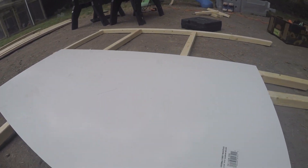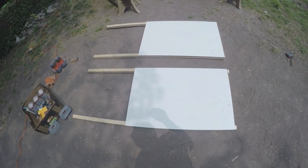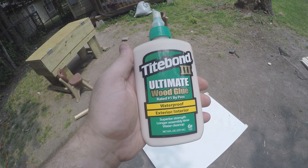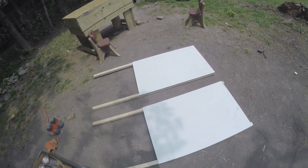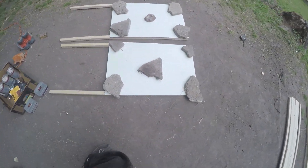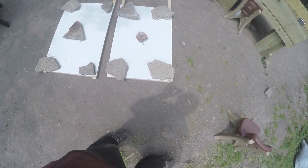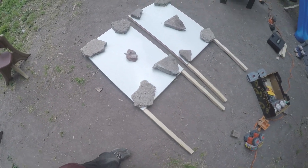What we're going to do is just cut this whole overhanging piece off, which will give around 36 inches of drawing surface on each side. The whiteboard pieces are cut and as you can see they now fit the frame properly. We're going to glue it down with some TiteBond 3 glue — this is great wood glue, it's all-purpose and really strong, takes about an hour to dry. Then we'll put the trim using 1x2s around the outside and screw that over the borders, which will create a nice tight seal and sandwich it in. They're glued down and I've put some rocks on top just to add some weight to keep them in place while the glue dries, since I don't have any clamps right now.